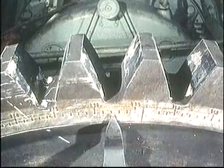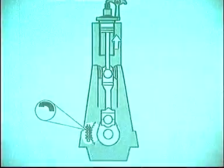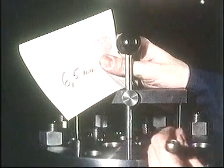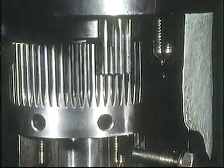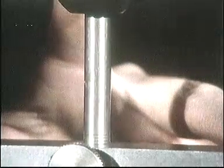Before adjusting the lead of the pump, make sure that the piston of the engine cylinder concerned is in top dead center. Place the measuring tool on the top cover and screw the pinion nut downwards by turning the adjusting spindle in an anti-clockwise direction until the measuring tool indicates the same setting as was noted down during the dismantling of the pump.